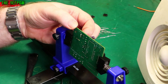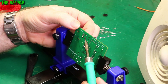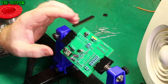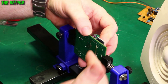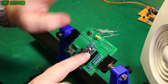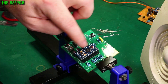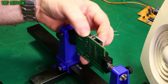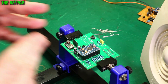Now I'll start putting headers in. This is the header for the OLED display — I'll just hold it in place with one finger and tack it in place. Now I've got a tricky bit of soldering for the Arduino. I've got to put the male headers on the Arduino itself and obviously the females on the board. I've put all the headers in place; the A6 and A7 ones I'm not actually using — this board doesn't have that footprint. But A4 and A5 I need because they run the OLED display. The trick is you put them in place together then solder on the Arduino side first — that way it's all lined up and you don't try to match them up afterwards. Then you can solder on the PCB side and get that done.